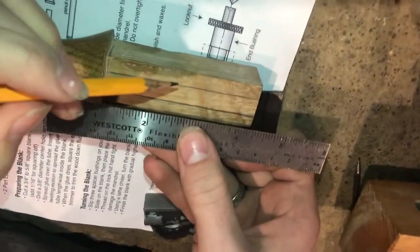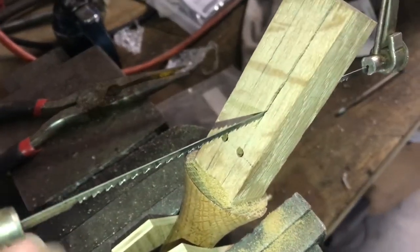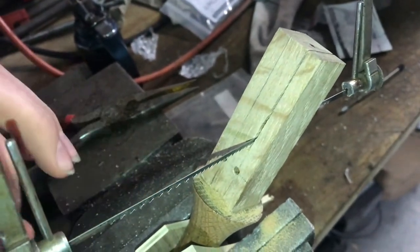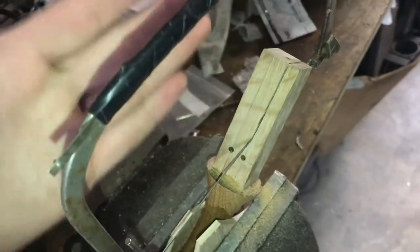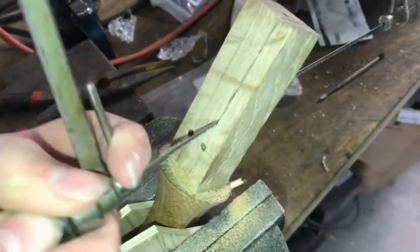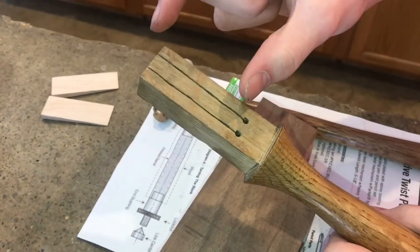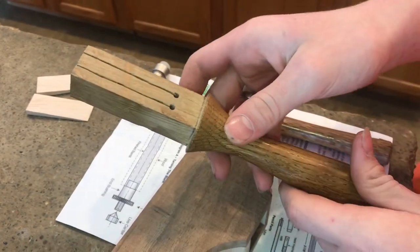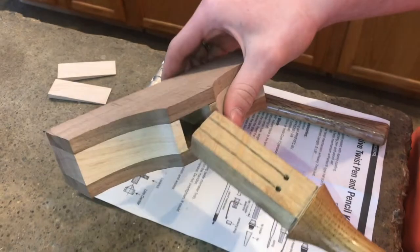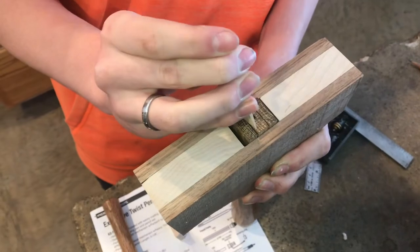I'm not going to make a cut all the way down — I'm actually going to go three quarters of an inch up. I drilled some relief holes down at the bottom here that'll help it split right there. We don't want it to continue splitting down the wood, so that'll keep it from doing that. Then I'm carefully cutting a slot down to that hole following the line — just got to take your time here. I'm ready to go ahead and pound in the wedges; I got the slots cut all the way down. Now I'll take some glue and put a little bit on the wedges. We really don't need much but it'll just keep them in place.